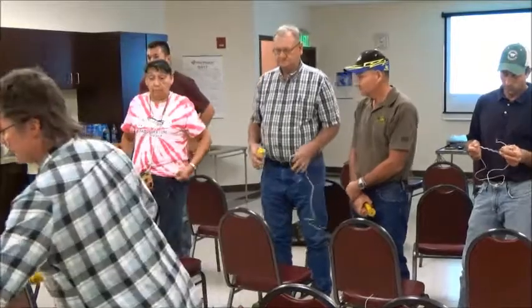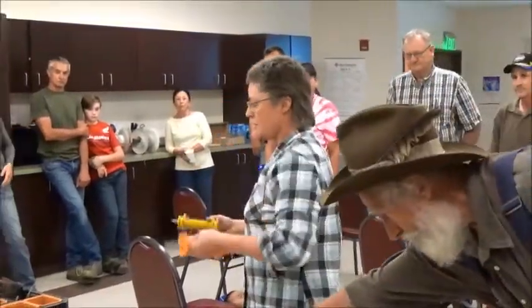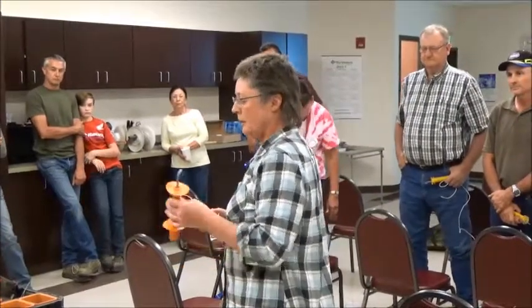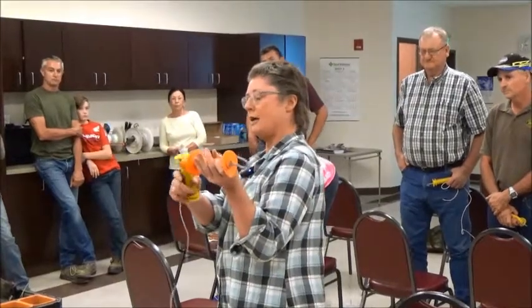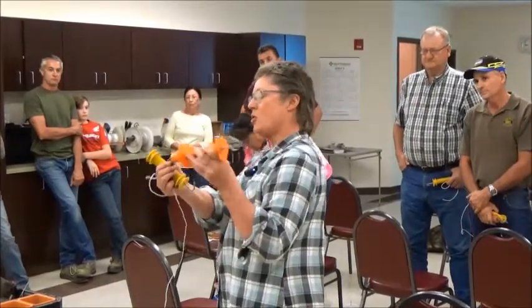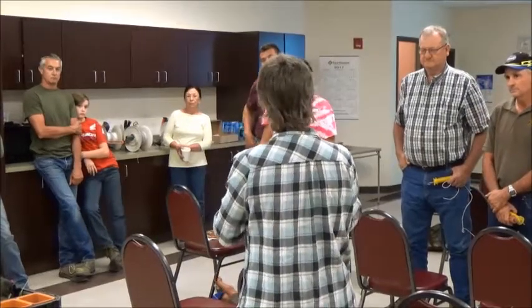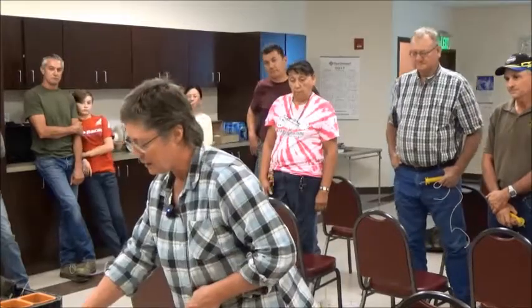Look at this lovely, expensive Gallagher hot handle. Really crummy. Because why? Because it weighs too much and it weighs your fence down. Don't buy them. It's also got a wire at the end, and I'll tell you, your twine will get caught in that wire. So don't. Buy a nice little cheapy Dare handle like this. They come in rubber and plastic.